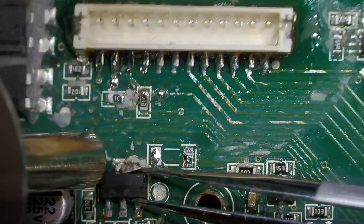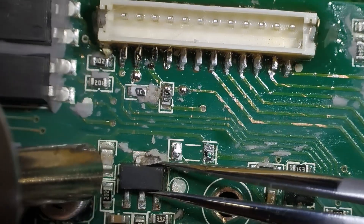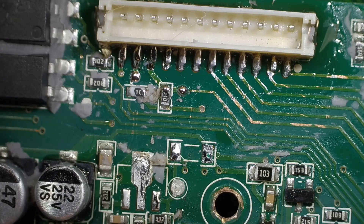I've removed that cap and cleaned back up. I'm going to remove this BL transistor now. This BL is an NPN transistor — pins one, two, three are base, collector, emitter respectively. I'll remove it with some hot air and see if our fault clears. The fault did not clear.